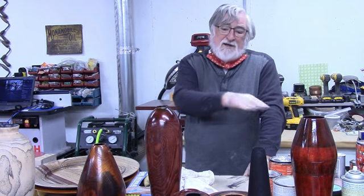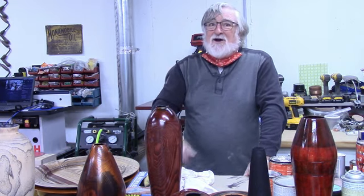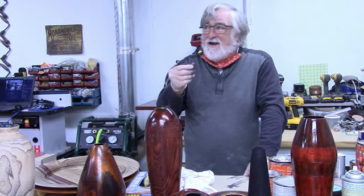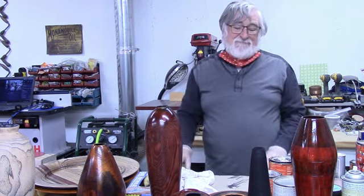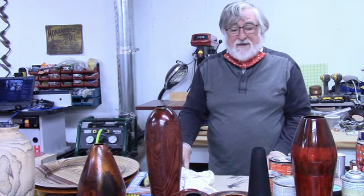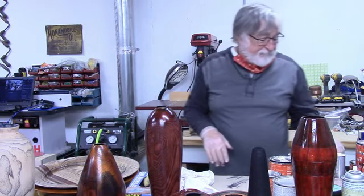If you have a different solvent, for example, if you're going to go to a lacquer finish and you're going to be lacquer sealing on top of water stain, it's pretty stable. But still be careful, because once you get that dye wet, if there's any particles floating around, they will tend to mess up. And it's ugly and it's messy as all get out.